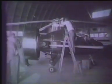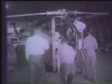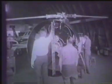The wheel or pulley just above the prop there, is that part of your? That's part of the spin up. Spin up, yeah. We had a belt drive off the back of the engine, and then a right angle drive, which was a car differential, and we had a freewheeling clutch at the top, and we had a big belt at the top. Terribly overstressed, but who cares? It worked. How much power could you get through that? I really don't know. We knew we were overloading everything, but the belt manufacturer would have had us put one in about 6 inches wide, but we had it, I think, 3 inches wide, and it still worked.